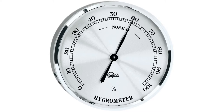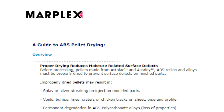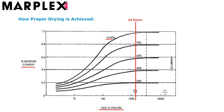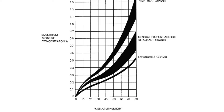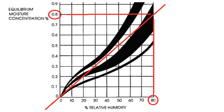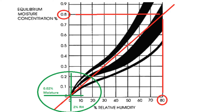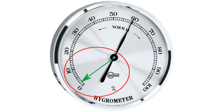Let's start by setting a material dryness goal and then see how to get there. For instance, the Marplex Corporation Guide to Drying ABS Plastic Pellets recommends no more than 0.02% water content by weight for plastic used in extrusions. We see from a chart published by Marplex that ABS plastic pellets will reach moisture equilibrium with the ambient air after about 24 hours of exposure. This next chart shows the correlation between relative humidity and the equilibrium moisture content of ABS plastic. We can draw a straight line slope and see that for each percent of relative humidity, the moisture content of the ABS increases about one one-hundredth of a percent. Therefore, to reach the Marplex recommended goal of 0.02% moisture, we would need a relative humidity of 2% or less. That is now our target relative humidity: 2%.